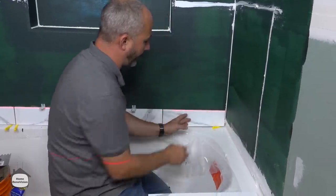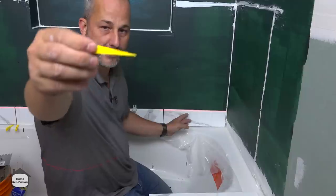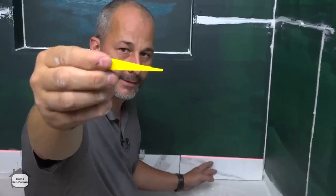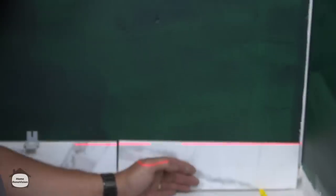Here's where the trick comes in — this little spacer has steps on it. The way it works is you put it underneath on the flat spot, and when you start turning it left, every time you hit another step it raises the edge of that tile.